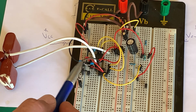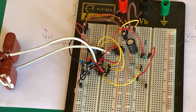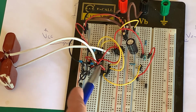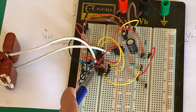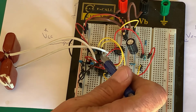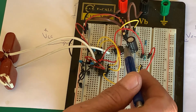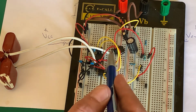Here I've just got two little capacitors in series to effectively halve the capacitance for my timing capacitor. In here I have our MC33063 IC. You can't see it nicely with all these wires, but that's our little MC33063 IC. There's our first inductor on the primary side, our secondary inductor over there on the isolation side.